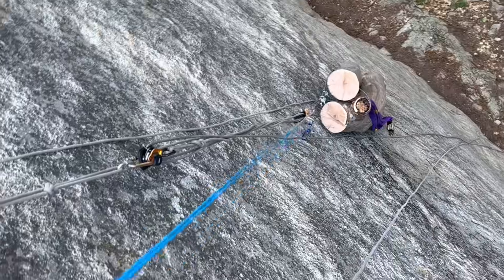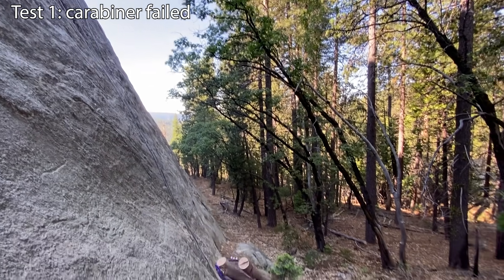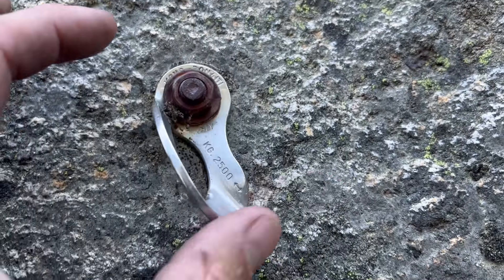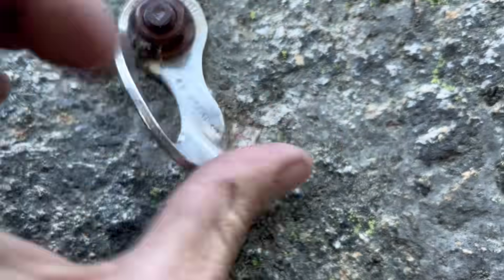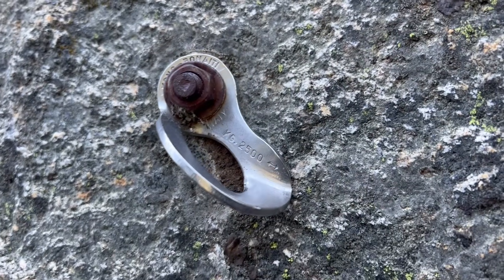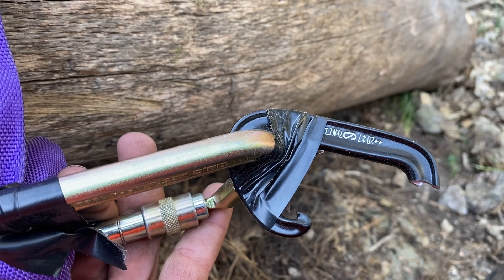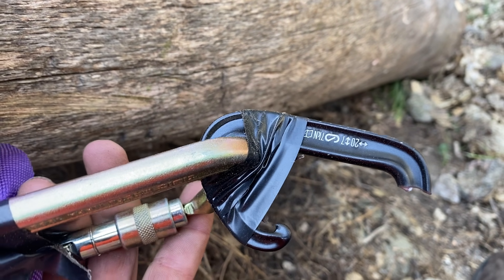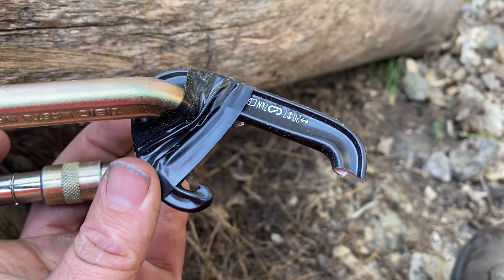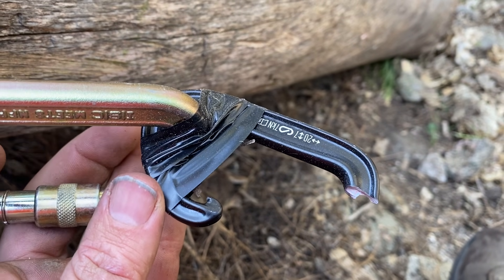This little blue cord is our snap shackle release. I have never seen a climbing hanger get deformed like that from a fall. That did exactly what I expected it to do. If we constructed this test properly, that means we saw at least 20 kilonewtons at the bolt carabiner, and the carabiner failed first — so that bolt, in my opinion, is still super strong enough to climb on.